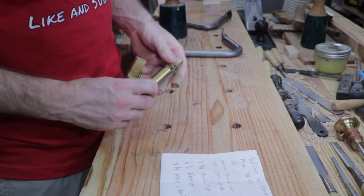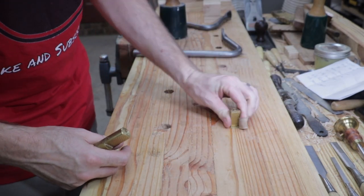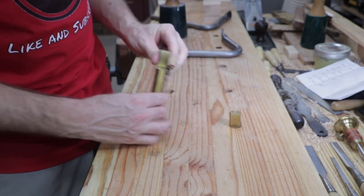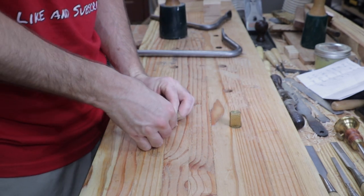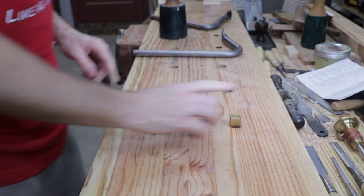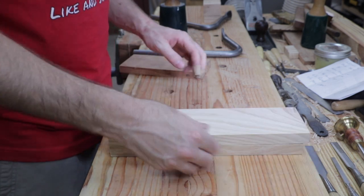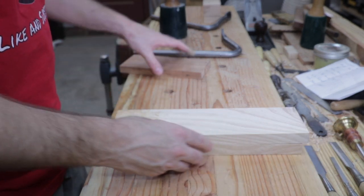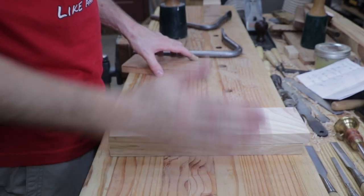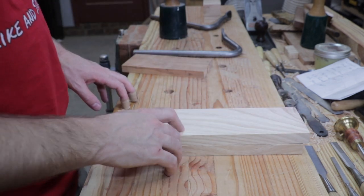The bench dogs are a great addition to the workbench. They can be placed in various positions and used to clamp items for planing specifically, but can be used for other things as well. In this instance we could use a piece of stock up against the bench dogs and plane against that, as we did when we were dimensioning the wood for the treadle lathe.